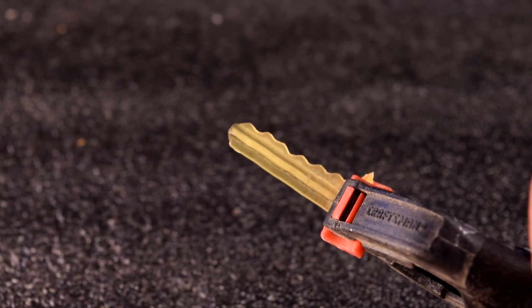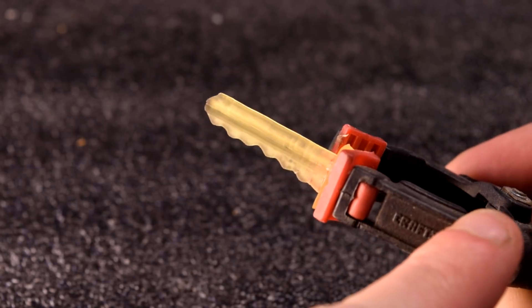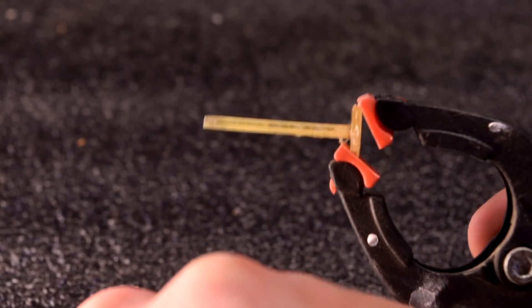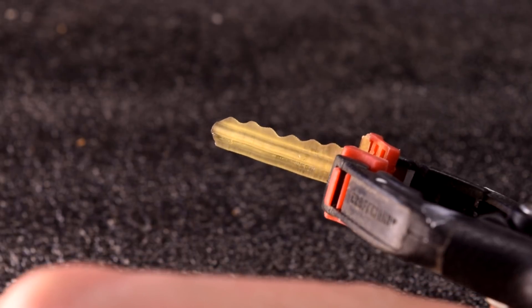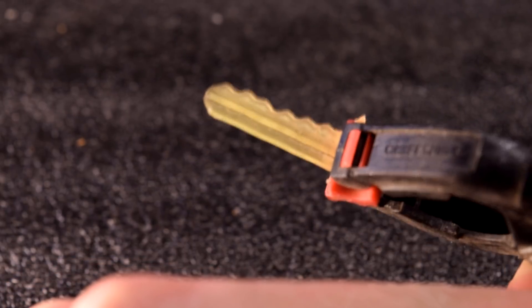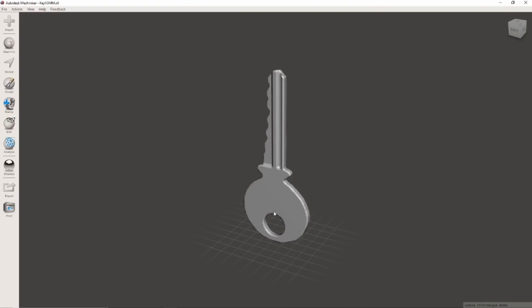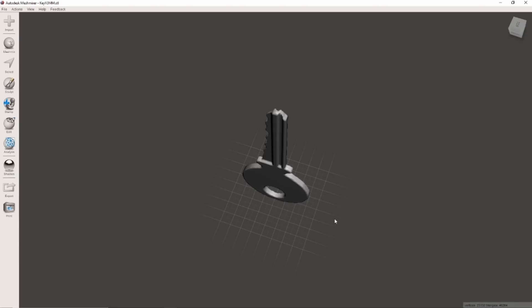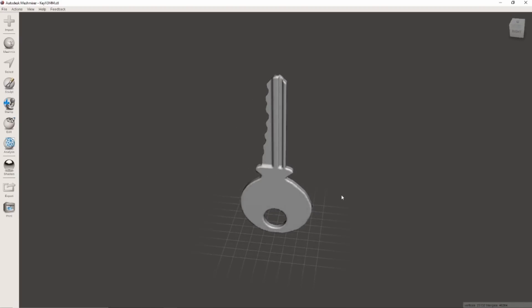I decided to break out the FL Sun S DLP resin-based printer to try to get more detail out of this model, and I was successful — the details came out beautifully. But I realized two things: one, the grooves needed to be deeper, they weren't deep enough in the original model; and two, the printer had some Reflect X setting that switched the groove sides, so that needed to be adjusted as well. I went back into Fusion 360, increased the depth of each of the grooves, and added the head to the model to complete it. I then exported it to the FL Sun's creation software, fixed the X-Reflect problem, and sent it over to the FL Sun to begin printing.